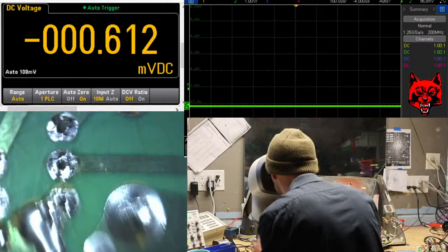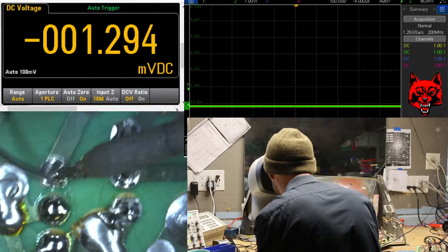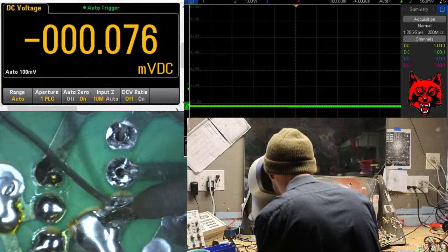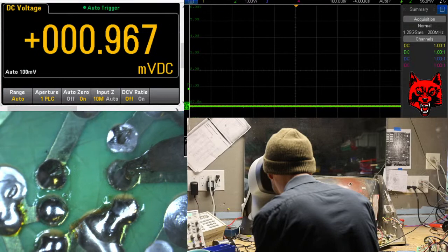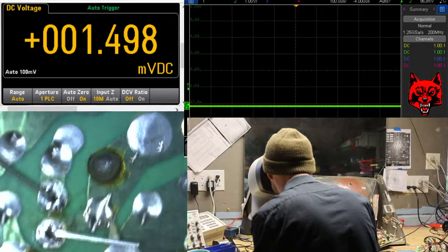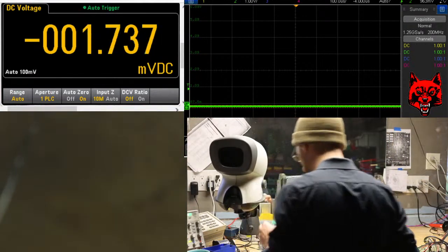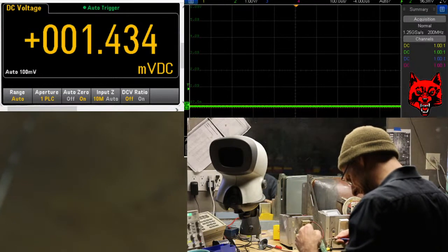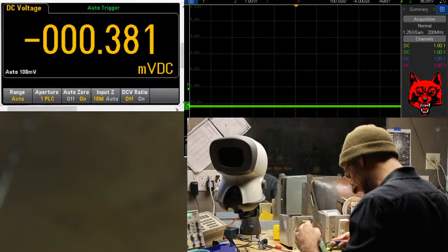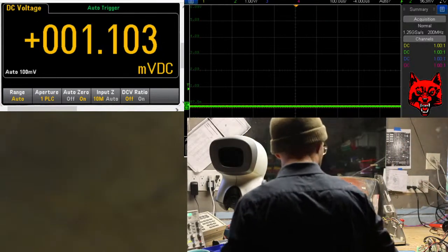There's certain situations where you want to cut the lead beforehand more than others, of course. But in practice, just always do it. Best practice. So that's what I'm going to do. Cutting the leads. And then I'm going to solder. They're fixed in place. They're not going to go anywhere. Now I can solder away.